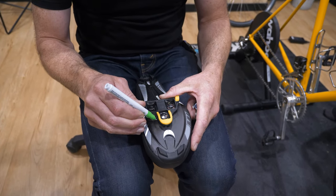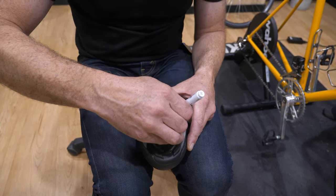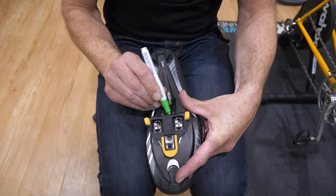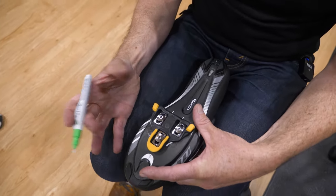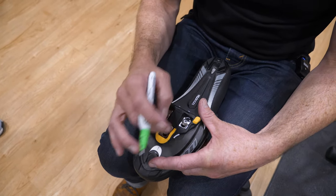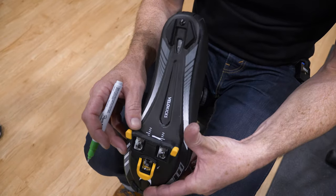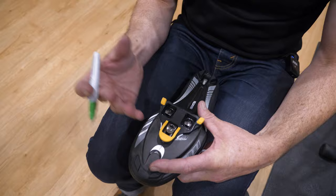One thing I've done for a long time that's really quite simple is to just mark out three points on that cleat — mark here, mark on this side, mark out those three positions. That way, when you do take the cleat off to replace it when it wears out, you've got a nice crisp line from a paint pen marking out those positions. It's really simple, really effective, and easy to do.